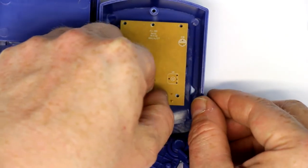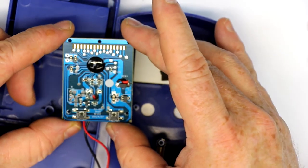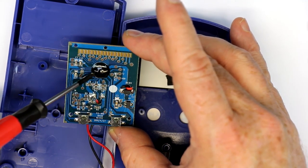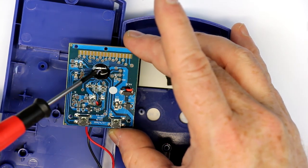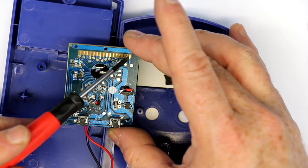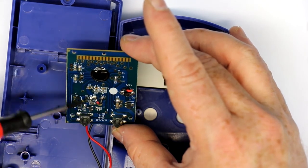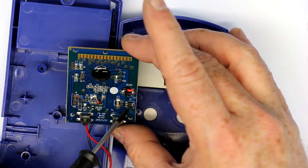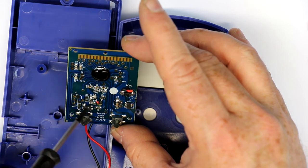And let's see what we get. Okay, we have a, what is it called, chip on board, COB. So the microcontroller, which obviously is one which can directly drive the LCD, is below the blob. And Q1, we have a transistor. U1, that's a voltage regulator, of course, to get the 9 volts from the battery linearly regulated down.